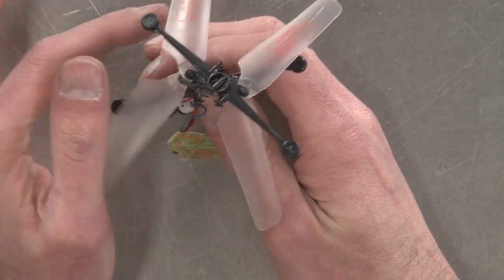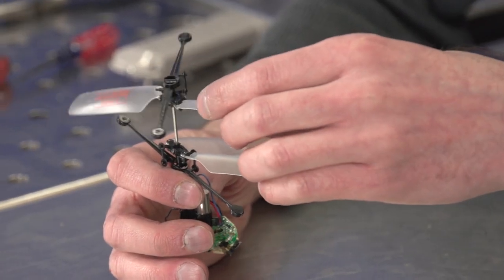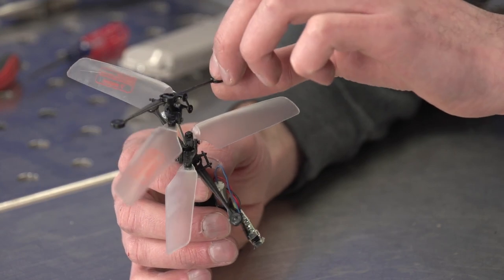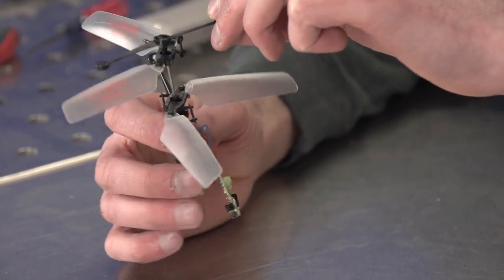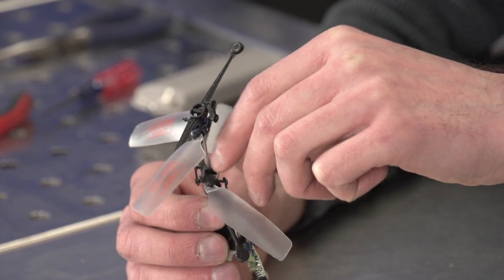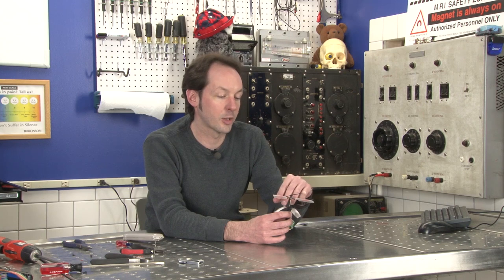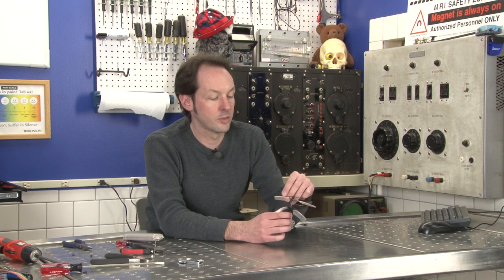Now to keep the blades balanced out, there are fly bars on top. This top one's broken — it's missing a link — but there's still one link there, so it still works, it's just not balanced. This gives us a very simple gyroscopic balancing. If it tilts this way, the fly bar wants to go horizontal, so it's going to tilt the rotor back — you can see it tilts like that. It's a very rudimentary cyclic control based on centrifugal force. That's how it works, and you see this in pretty much all the little coaxial copters — they'll have a basic fly bar system. My Blade SR still has a fly bar on it. So it's really simple cyclic auto-control to a limited degree.